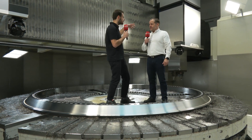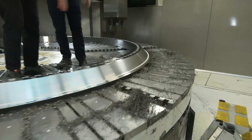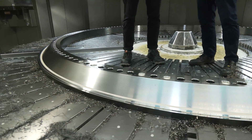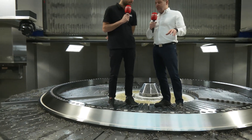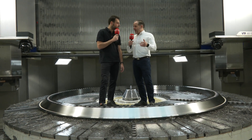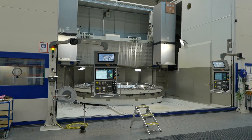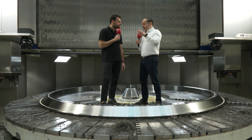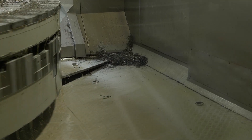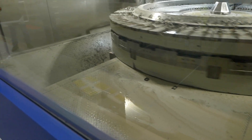We've talked about the way the machine handles vibration and temperature control. But what about work holding? I can't see any clamps — there's just a single cylinder locating the part. Be very careful: we're standing on a magnetic table. This is a finishing process, so clamping would probably damage the finished part. For that reason, the whole table is magnetic, and we have different levels of magnetic power. The whole machine is customized for the customer — not only the machine process and the cutting process, but also how we reduce non-productive time, such as cleaning the machine, where chips fall very cleanly. You'll see later how the platforms open so the operator can reduce non-productive time as much as possible.